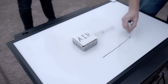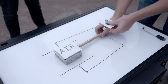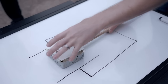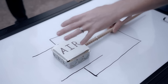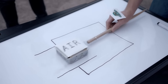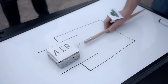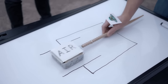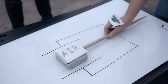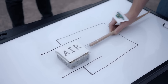So let's draw a speaker box here, and we're going to have an opening where air can come in and out. I'm going to put this little speaker icon on my hand — that represents the speaker driver. The spring represents the air inside the box, and this weight represents the air just hanging out as a block inside the opening. At very low frequencies, you can see that the direction of my hand and the air are going to be in opposition with each other to the outside world. And the faster I go, there comes a point when the direction changes, and then suddenly my hand and the air are moving in a way that produces sound that stacks up together. Also notice how there's this point right around when the direction is starting to change — when I have to move my hand very little for there to be a lot of air movement. Then if I move my hand really fast, my hand moves a lot but there's little air movement.